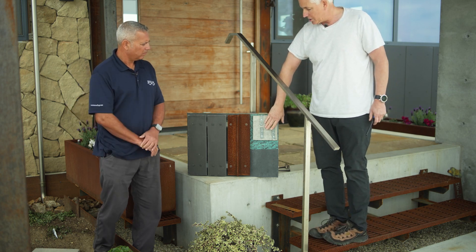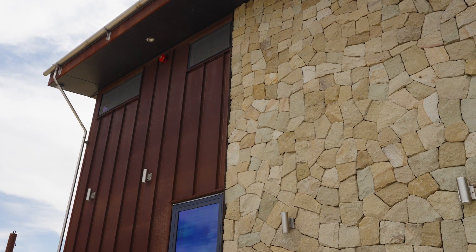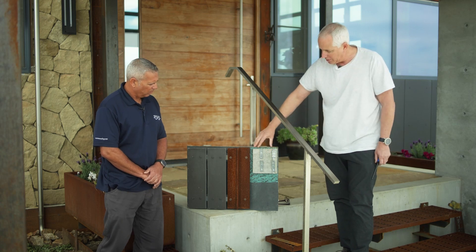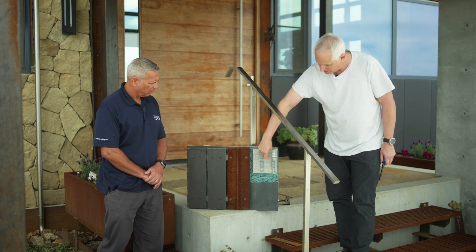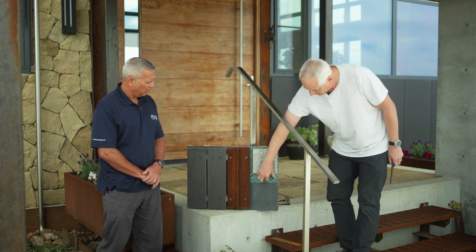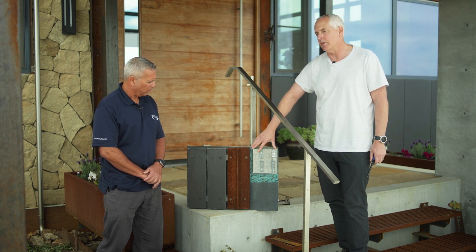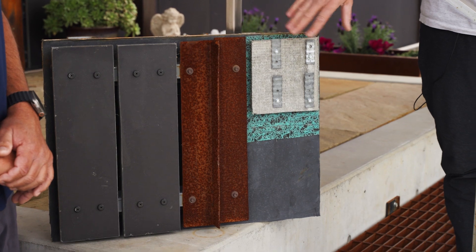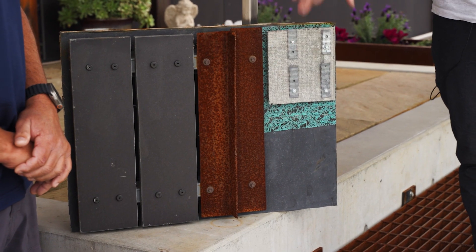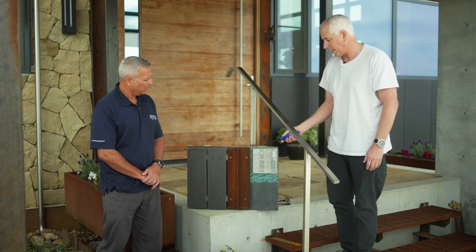There is one additional layer behind the rock that you see here. I have a membrane that allows any moisture that gets between this concrete board and the gypsum board to escape — it allows air to be in between that space, so if any measurable moisture gets in there, it goes away. And on top of this is what the rock sits on, so none of this is flammable either.